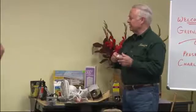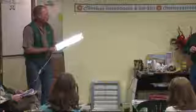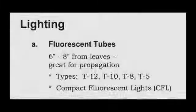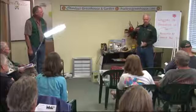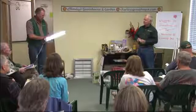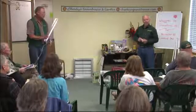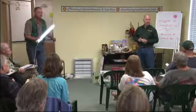We've got a fluorescent here — we'll show you what a T5 fluorescent looks like. The T5 is the newer, smaller diameter tube. This is just a 24-watt bulb and it's only a two-foot-long fixture. It's effective for plants 12 inches wide by a little over two feet long, and it's going to have probably one and a half times the output of the old T12 type bulbs.